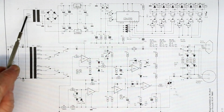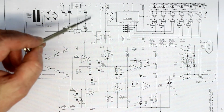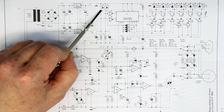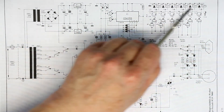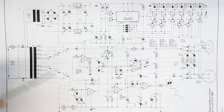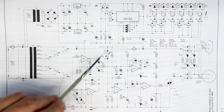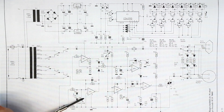On the upper side we have a secondary transformer for the logic and display, providing plus and minus five volts. The centerpiece is a forward-backward counter, operated with two push buttons to step one forward or one backward. With a little logic, the six relays switch the taps from the secondary winding and are cleverly combined so you get exactly 10 volt steps. And here we have the security section — the electronic fuse with a temperature sensor and overcurrent measurement. And basically, that is it.